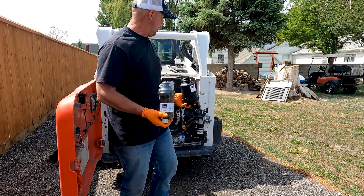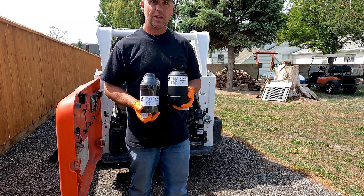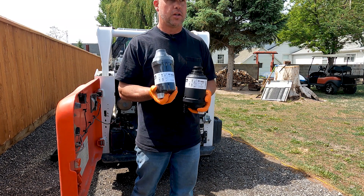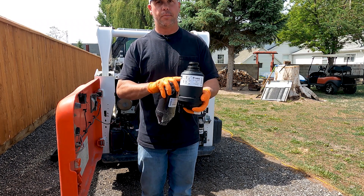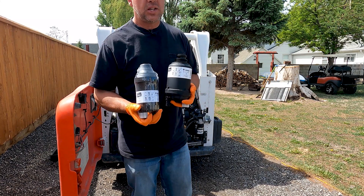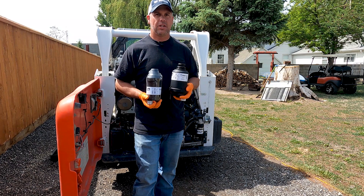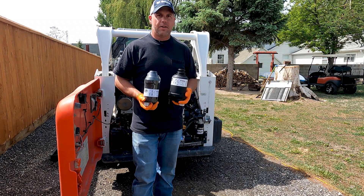Although it is bigger, there's not a lot of space in here for these fuel filters, but this filter actually does fit. On some machines it's tight, but it does fit, and this is the filter that you are going to have to go with now. Your dealers have probably already exhausted their old stock on the 702-3589 that we've been using for years. So they supply you with larger worm gear clamps to fit this in there. The only machine I'm aware of that needs an extra bracket — which Bobcat will sell you — is the Excavator, the E85. They'll give you a bracket to relocate it a little bit. So let's slide it in on the T595 here and show you how it fits.